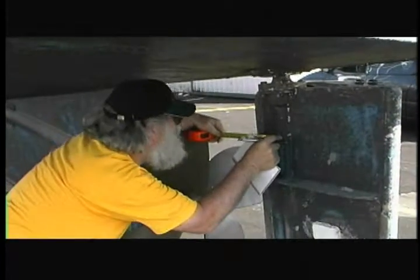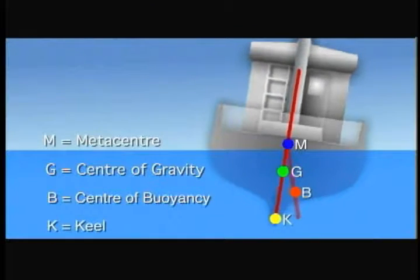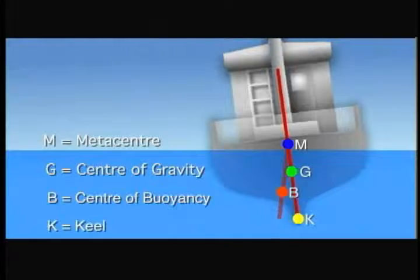"We're going to need to have a lines plan for the vessel." "What's a lines plan?" "A lines plan defines the shape of the vessel — it's almost like a three-dimensional drawing of the exact shape of the vessel, the length, the breadth, the depth, giving the shape of every section through the vessel." If you don't have one from your naval architect, then we have to measure the vessel and develop it from those measurements. A lines plan tells the naval architect the shape of the boat, and the shape of the boat defines at any given draft its displacement, its center of buoyancy, and its initial stability characteristics at that draft.